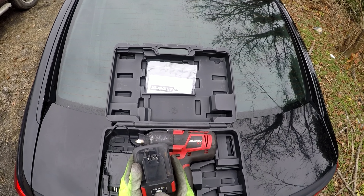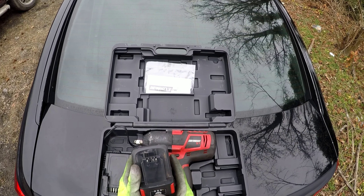There's your charger right here. If you have your charger, you plug it into the wall, but if you have an inverter on the truck you could also plug it into the inverter to charge your battery. Just put the battery on there to charge it. You'll know it's charging — the light will flash green when it's first charging, then you'll have a steady green light. To take the battery off, squeeze the red sides and pull. If you want to see how much power you have in the battery, just press this button right here — as you can see, it's fully charged.